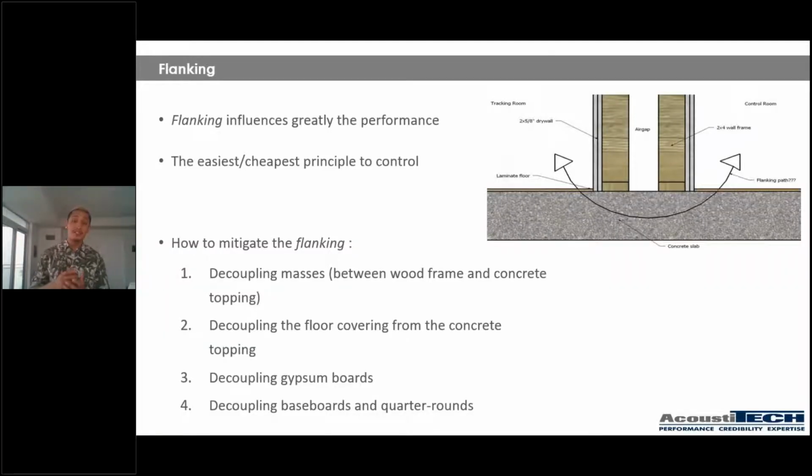So guys, as you saw, this is the tiniest thing. This is a small music box that we simply played by itself, then put up against the wall. And you could see just how much that sound was amplified. Notice that this is not a sound system. This is not somebody jumping on the floor. This is the tiniest thing. And this is why it's so important to decouple materials, because anything can transfer energy and can transfer sound and even amplify it to some extent.